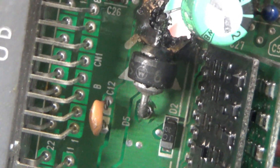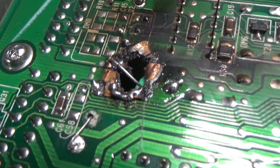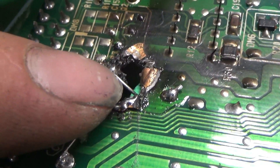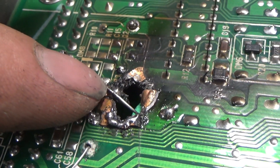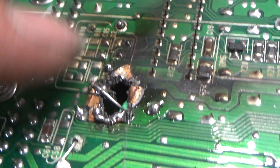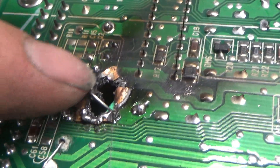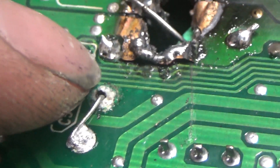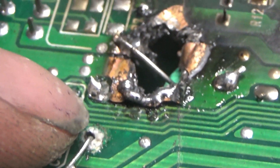We'll go back to that — it's a resistor, if you would. Okay, burnt up here. What we've gone ahead and done is simply taken the positive leg from the capacitor and connected it up to the end of the resistor that goes in line with that 12 volt connection. Over here, the capacitor that had a small hole in it completely took the pad with it.